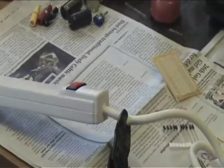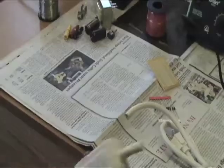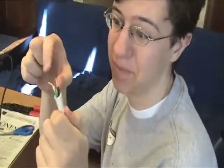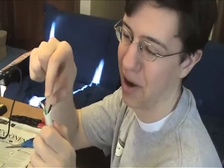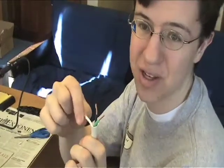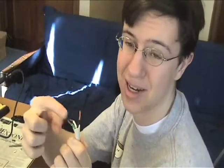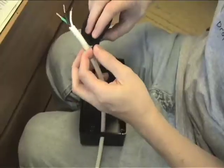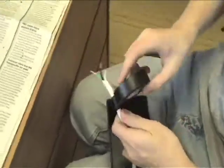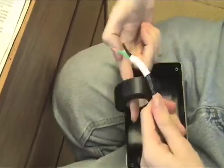Next, take your wire cutters and void the warranty on your power strip. Now use a knife and peel back the outer insulation of your cord, leaving you with three wires. Assuming this cord is wired properly, the black wire is the hot wire — it carries the voltage from the wall outlet. The white wire is neutral, which at the service panel, assuming it's wired directly, should be tied to the green wire, which goes to protective earth ground. Put a relatively thick layer of electrical tape around the insulation of this wire.